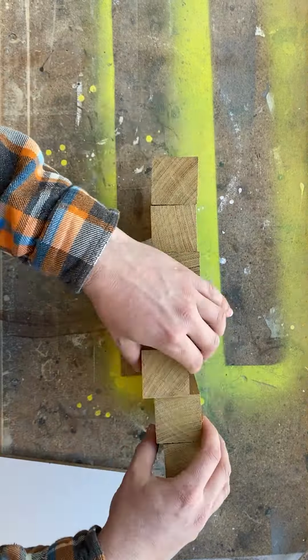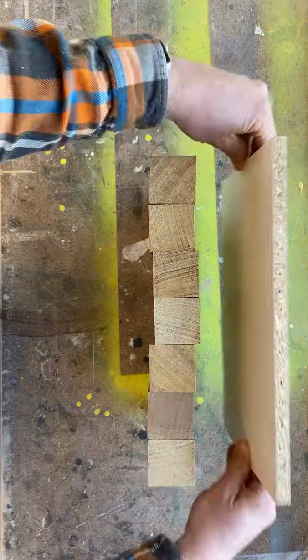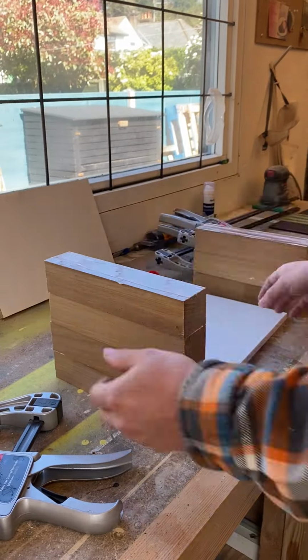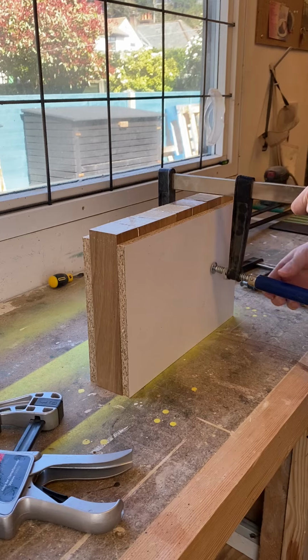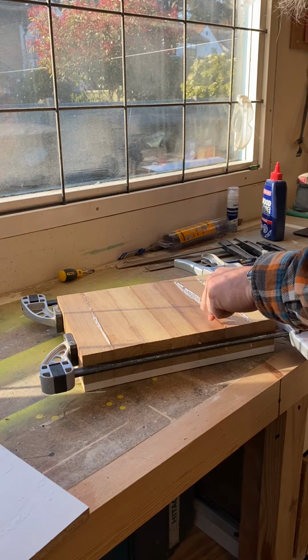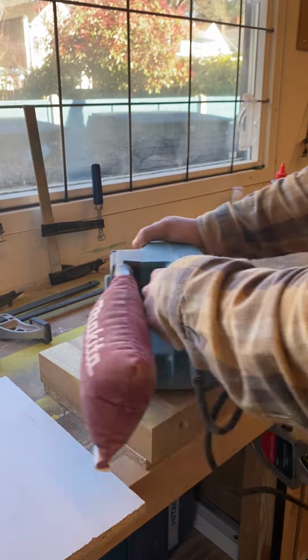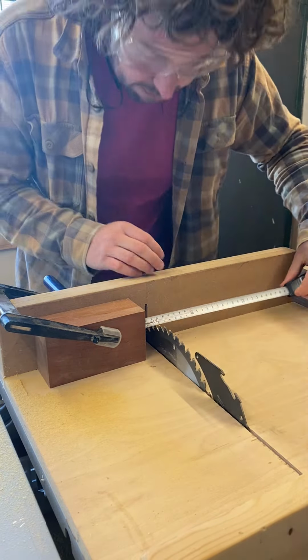I shuffled my staves around so the pattern would be more organic, then glued it all together and clamped it into a melamine sandwich to try and get it all as straight as possible. After half an hour I scraped off some of the excess glue, then the next morning sanded off what was left to try and get as flat a surface as possible.